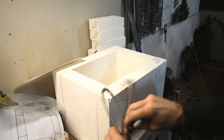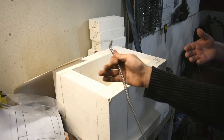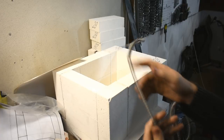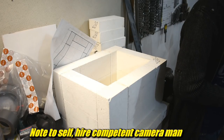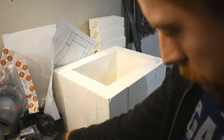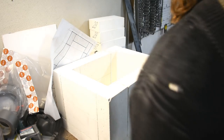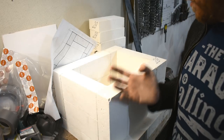And live struggling with a twisty tie on camera. Okay, will it stretch? I can make it stretch. We are measuring the element length. Element length, if I pull it relatively taut, is 123 inches. Don't have to stretch it that much — don't even have to stretch it at 10 inches. Neato. So that's one issue I don't have to worry about. Size, good. Element, probably going to work.